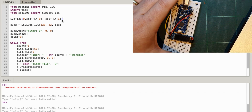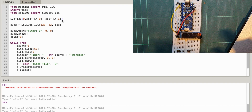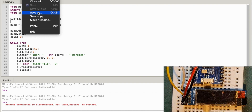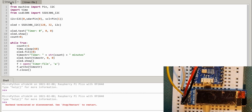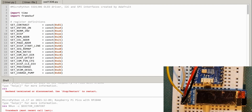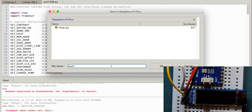So let's zoom in a little bit. You can see the screen - let's plug it in. The OLED shouldn't start yet because this program's not on there. So let's save this - main.py, save as, save it to the Raspberry Pi Pico. Nothing on there as expected. I'm going to call it timer.py. Hopefully that's on there now. If I run that - I need to copy the SSD1306 library to it as well. Let's open that, and file save as Raspberry Pi Pico, SSD1306. If you remember from many videos ago, that's the driver I use for that screen.